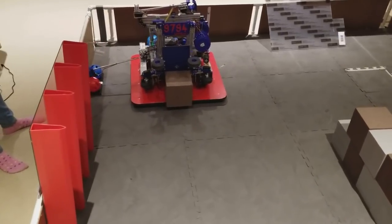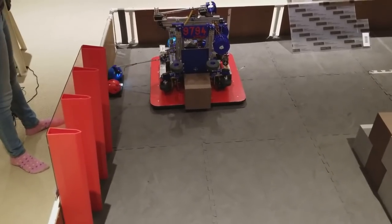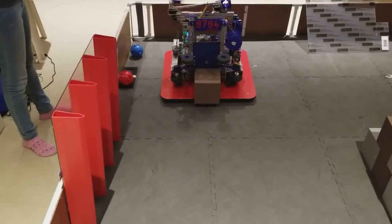The way our Autonomous works is that the first thing we do is knock off the jewel. We have two servos — a pan and a tilt — to control an arm, at the end of which is a color sensor. The sensor goes over the ball, detects its color, moves in between the balls, and then knocks off the right one. We'll talk about the jewel in the next video.